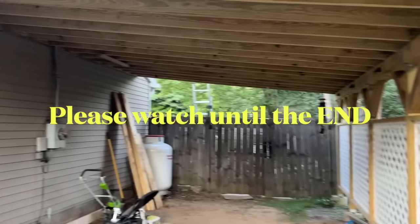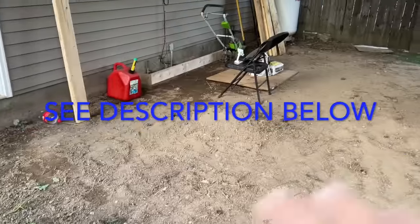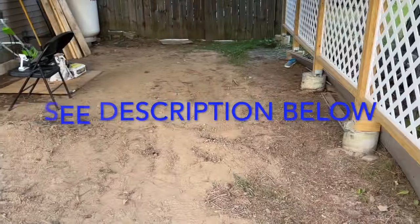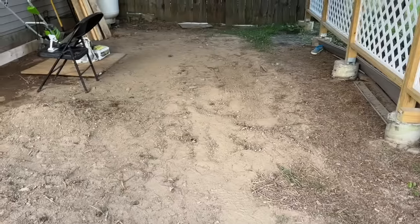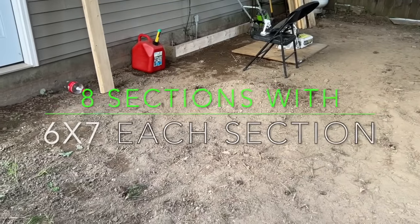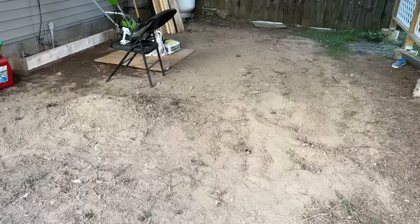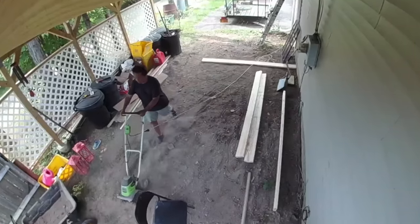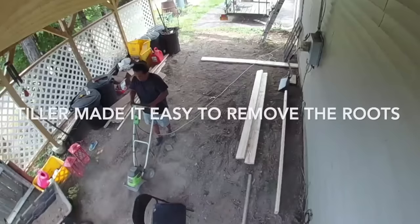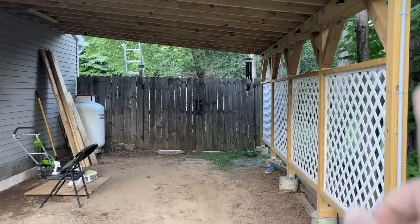Here's the carport that we had finished last November 2022. Now what I'm going to do is start prepping the area to put a concrete driveway through. To make it more manageable as a one-person job, I'm dividing it into eight sections. I did start flattening everything out using a rototiller — not only to break up the dirt and flatten it, but also because this whole area had nothing but grass. It measures 24 feet deep and 14 feet wide.